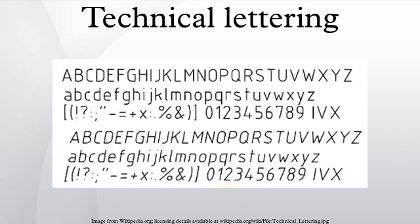Mechanical lettering is sometimes done using a pantograph, a device consisting of four bars pinned to each other to form a parallelogram. The links can pivot about these pins. The lowermost link of the parallelogram is fixed to two rigid supports. One vertical link at one end is connected to a profile tracer, which traces the profile of the letter to be drawn, and the second vertical link and the other horizontal link are jointly connected to a pencil that draws the exact shape of the profile traced.